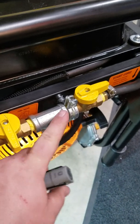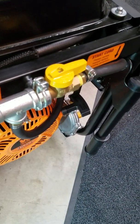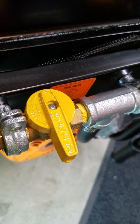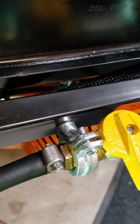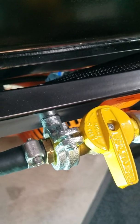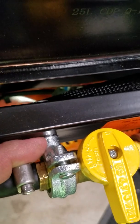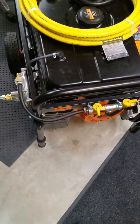The standoffs were a real important thing for me. A guy I saw had the same sort of manifold but it was all hanging on there pretty hokey — I wanted mine solid. I found these neat standoff clamps for black iron pipe, designed as pipe hangers, tapped on the back with a 3/8 thread bolt. I picked up some galvanized hardware, drilled holes, and cut the bolt to the right size so I could screw it down solid — this ain't moving. I used through bolts through the frame and added Loctite on everything because it's a generator and it's going to vibrate.